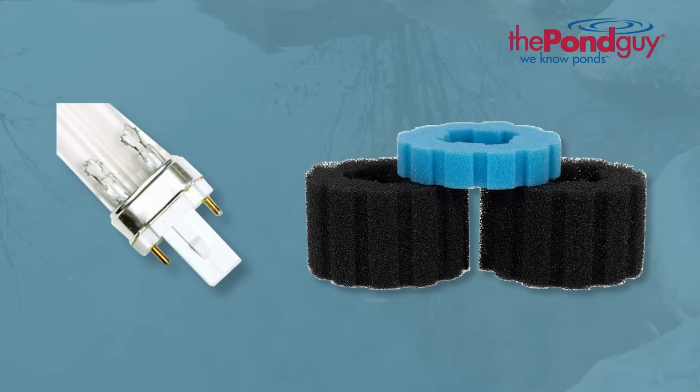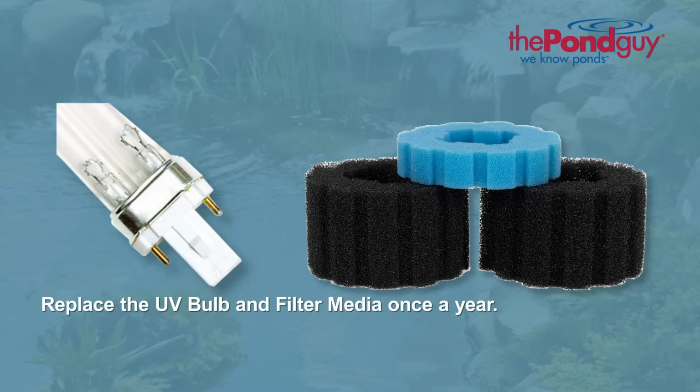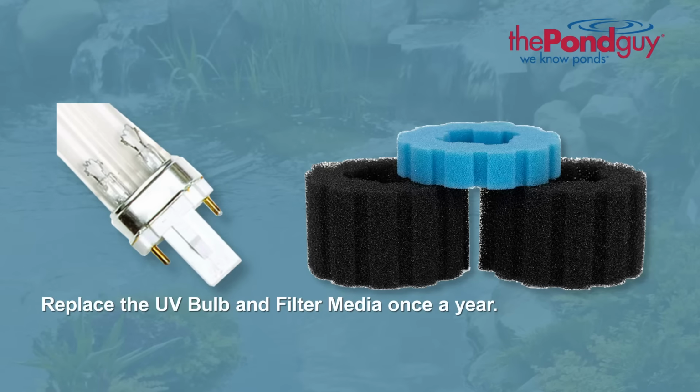However, over the course of the year, the UV bulb and filter media pads degrade and become less and less effective. To ensure your pond water stays crystal clear, we recommend replacing the UV bulb and filter media once per year.